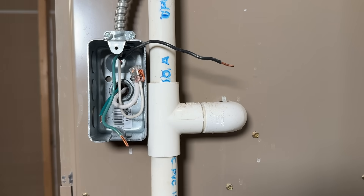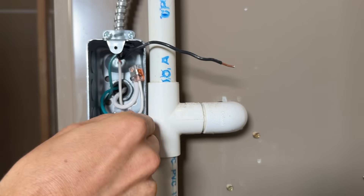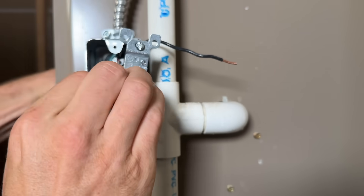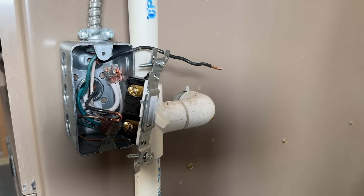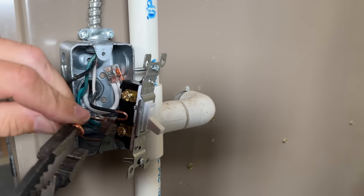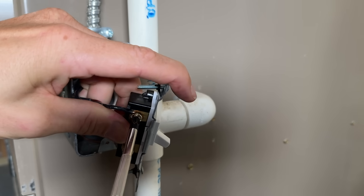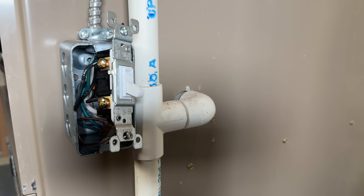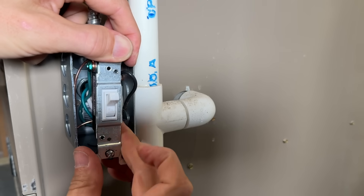I'm passing the neutral from the metal clad through to the furnace neutral. For the grounds I'm bringing together the ground from the metal clad, the ground bonded inside the furnace, and the pigtail ground for the light switch — using a three-wire WAGO lever nut. Then a two-wire WAGO on the inside passes a solid core pigtail as the hot conductor to power the furnace. On the single pole switch, the two gold terminals simply connect and disconnect — provide power to the top gold terminal clockwise. Note: single pole switches have an orientation, so flip it so the up position is on and down is off.